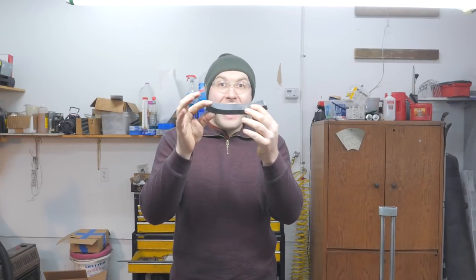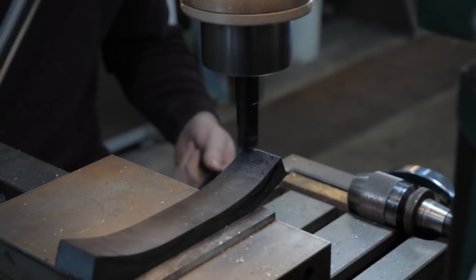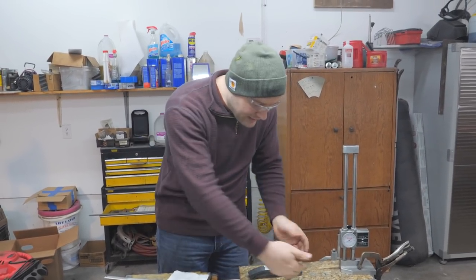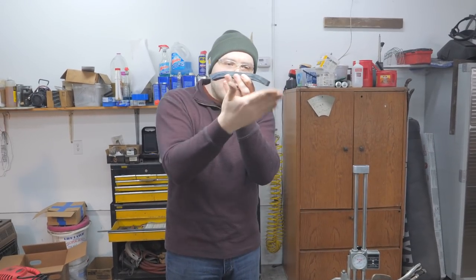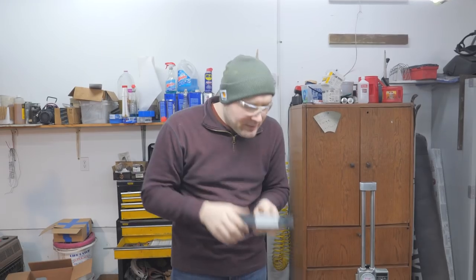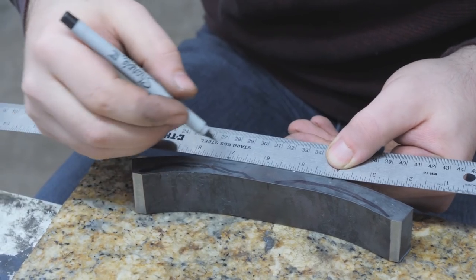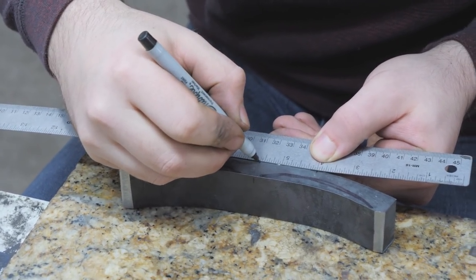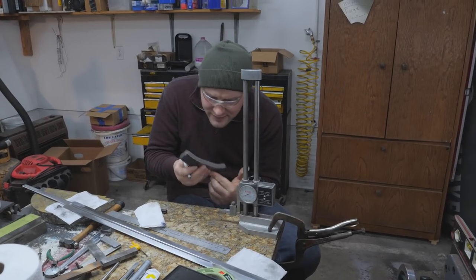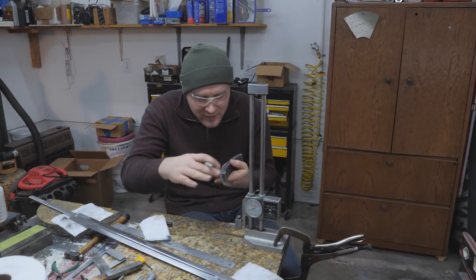Twenty minutes later — I now have some flat surfaces I can reference off of. I milled some tiny flat ledges so if I put it on a flat surface it's nice and flat and I can make reference lines on it. After getting those flat surfaces, I went over to the surface grinder and surfaced the part where the handle fits up. The next part is to find the center, mark that, figure out where the bottom grind of the quillons need to stop, and start grinding a radius in. I keep adding reference lines to make sure everything comes out uniform.